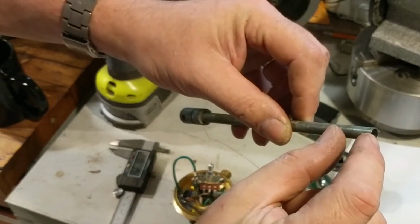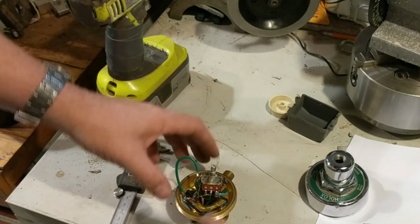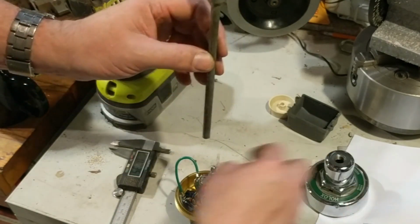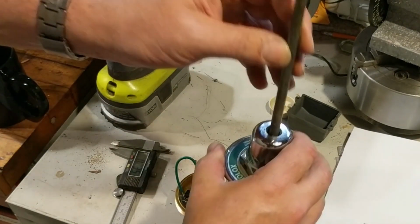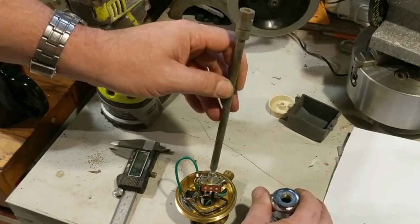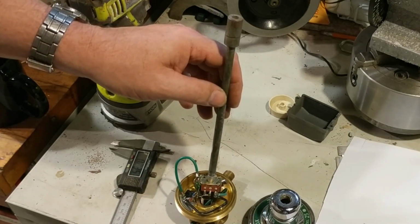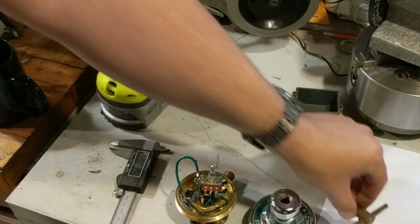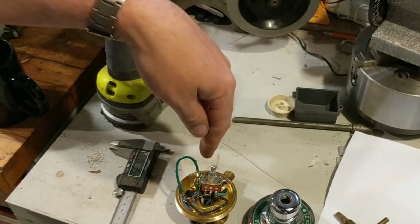It's just a shaft with a 236 hole drilled here. This shaft is 235. And so it fits this shaft nice and clean. After I have the potting compound applied, I'll screw the lid on a little bit and poke this down in there and engage the shaft to confirm that I have it in the center and in good alignment, so that later on I won't have problems with this thing engaging properly. It will be lined up in the center of the hole, and it will be straight with the axis of the hole.